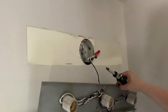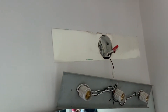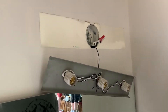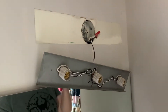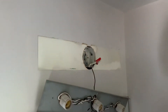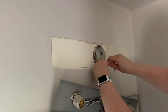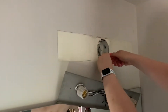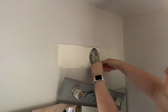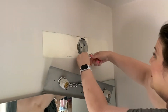There are my wires, and you can see that whenever this bathroom was painted previously by a previous owner, they did not pull the fixture down. I would recommend that anytime you paint, you pull this down and not paint around your fixtures. We are going to be painting this bathroom, so I'm not going to bother fixing this right now — when it comes time, I'll loosen my fixtures and paint behind it.